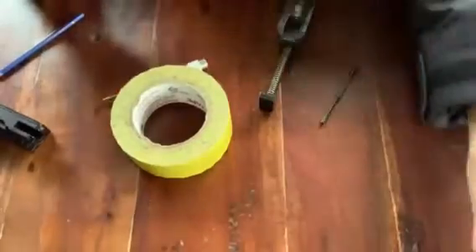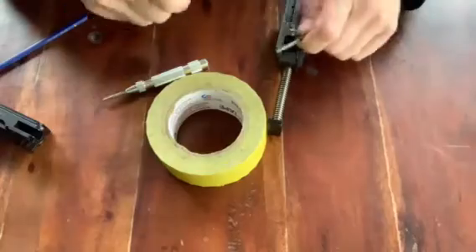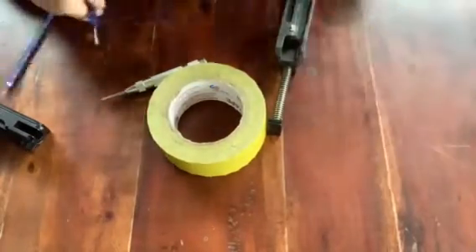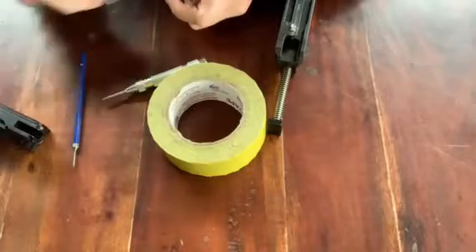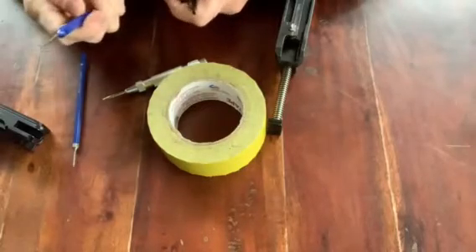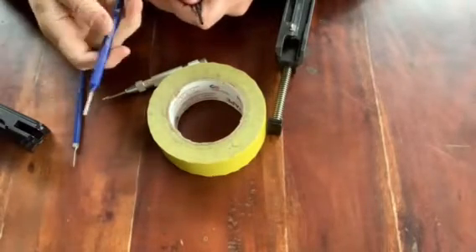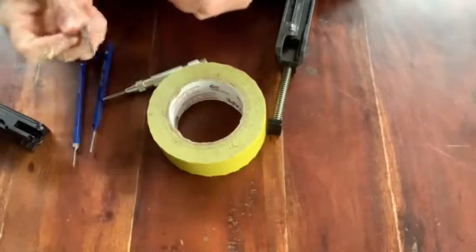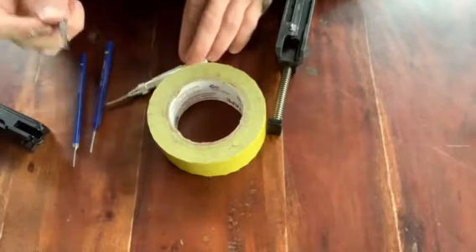Let me position the camera so you can see. A couple of things that you're going to need: you're going to need a roll of tape, or you can use one of those little pin blocks if you happen to spend the money on it, but a roll of tape works just fine. You're also going to need a 1/16th punch. You will also need, for the purposes of this, a 1/8th punch — a similar-sized Allen key should work just fine, but I prefer to use the 1/8th punch. You will also need a roll pin starter punch; these usually come in packs, so these are super helpful.